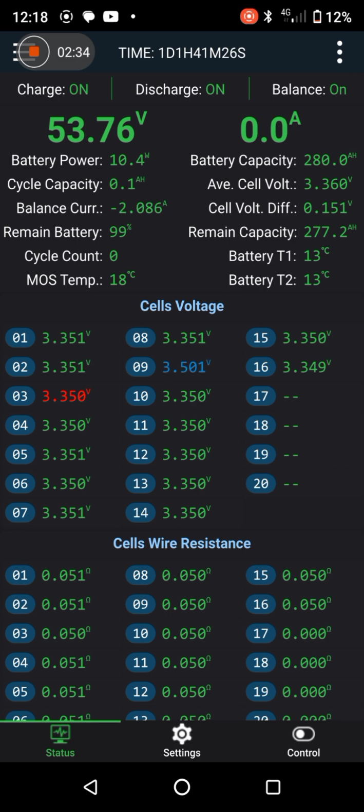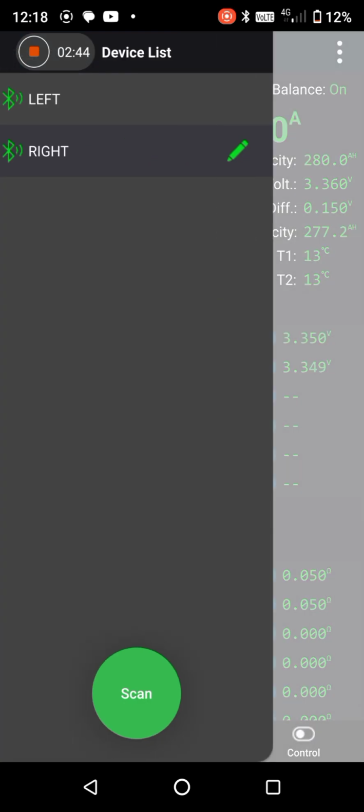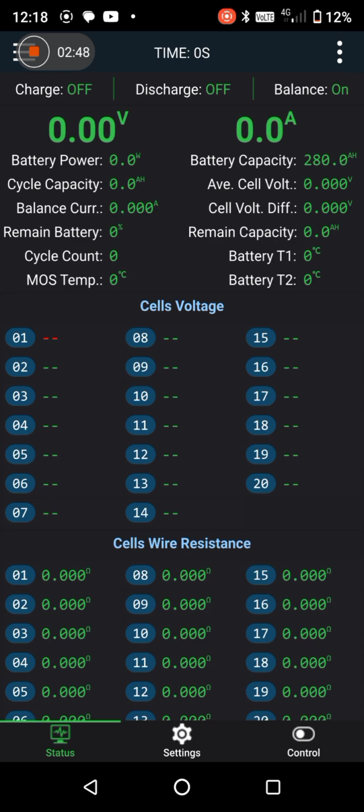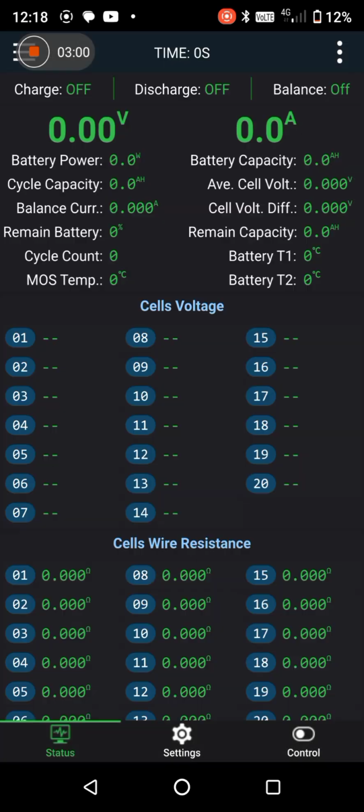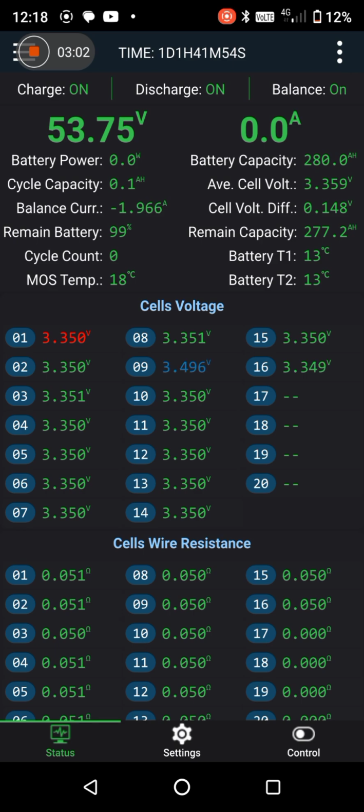So that's the charging circuit back open. There was nothing flowing from side to side at all. Neither of them are recognizing the 2 amps coming from the inverter. Well, this side says 0.8 of an amp leaving this side. So it's probably below the threshold of being able to recognize anything.